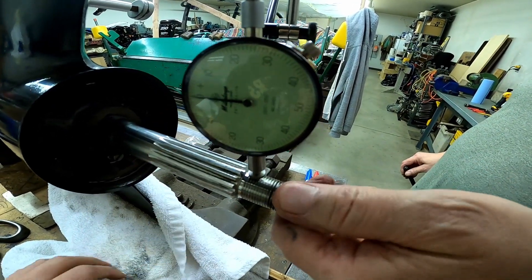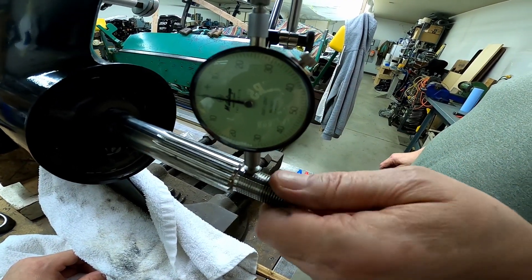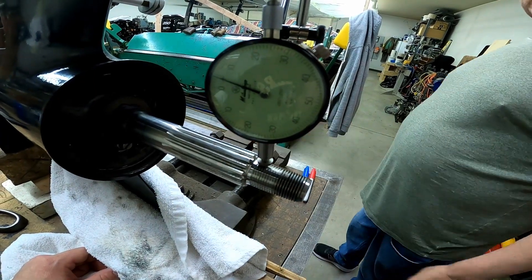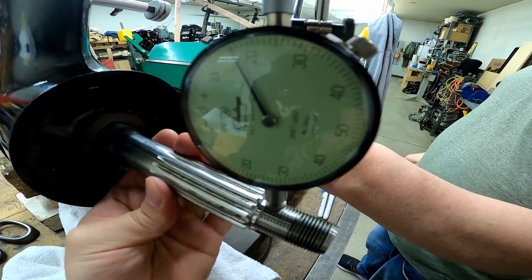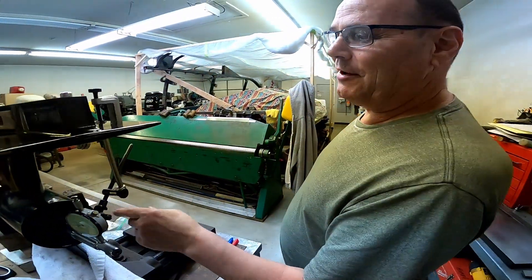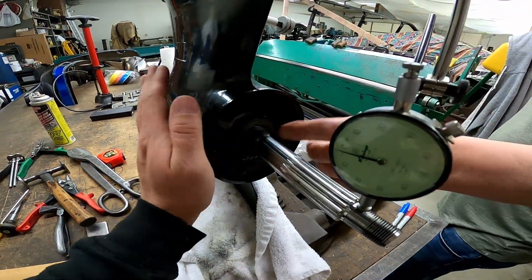From 6 thou you could probably run it without a lot of issue, but 9 is the limit for Mercury. At that point you're probably looking at replacing it, because it's going to take out all the bearings in the carrier and cause gear problems with the vibration. And since this thing was getting water in it — it holds a positive pressure test for hours on end, even when you're moving the shafts — I would say this is vibration-caused when it's running. That's why we think it had water in it.